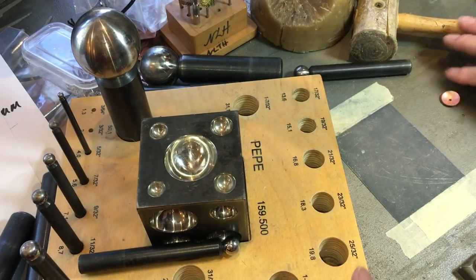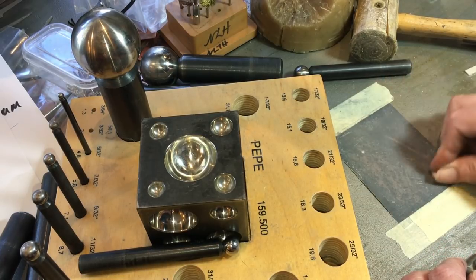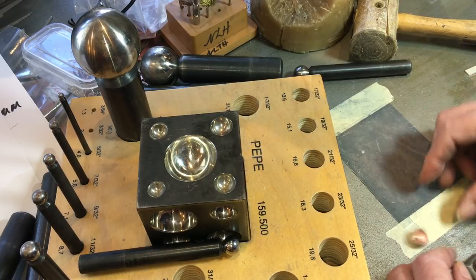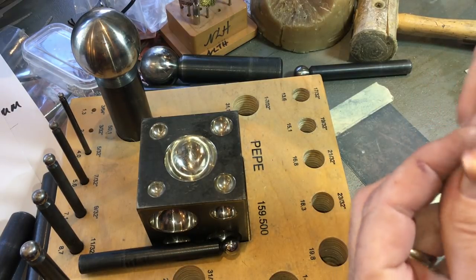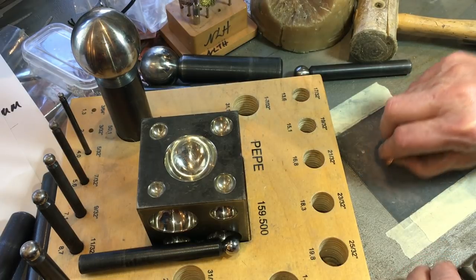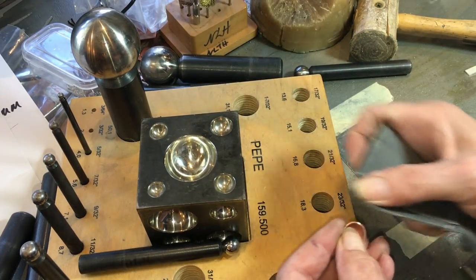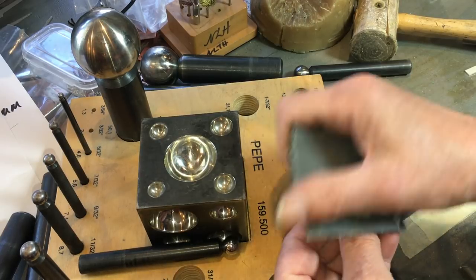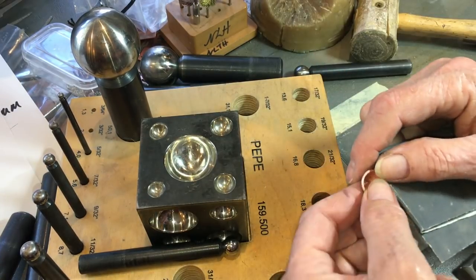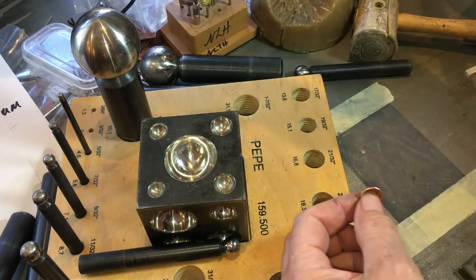Take the cup and put it on some sandpaper — 320 grit, then 400. You want a nice flat edge. You always have burrs after filing, and you want to take any sharp edges off. Rest your hand on something — otherwise it's not as effective. I have nine of these to make, so I'll be back in a minute. I have class in four hours.